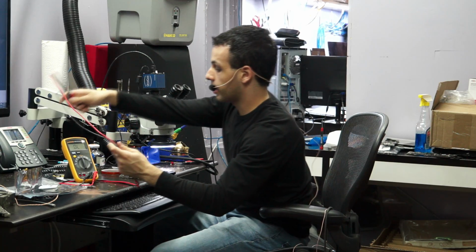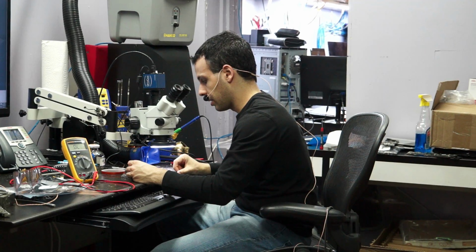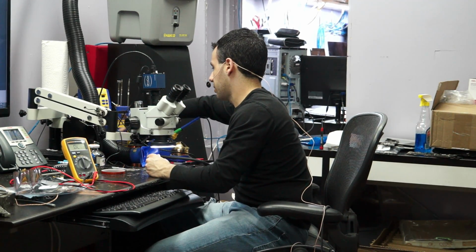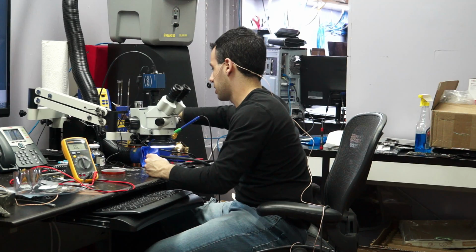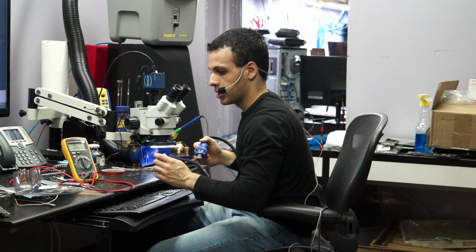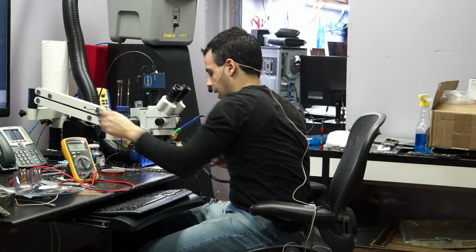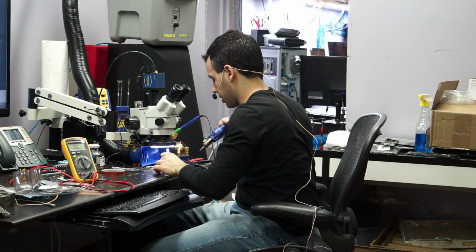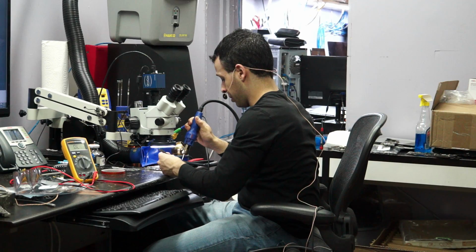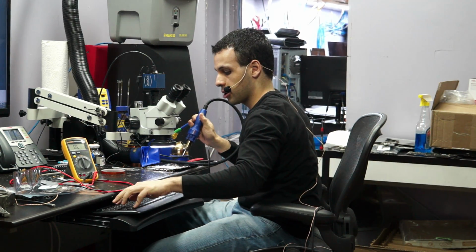Now, honestly, the amount of time it's going to take for me to run power through it is actually less time than it would take for me to simply remove the very few components that usually go bad in the backlight circuit, which is the LED driver, the LCD connector, or the output caps in that particular order. Now here, I'm going to guess that it's not the LCD connector because this was in water. This was a do-it-yourself screen replacement. So I'm going to start by removing the LED driver, so let's see if you can see that in the screen.